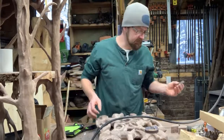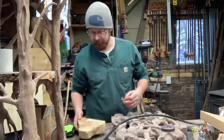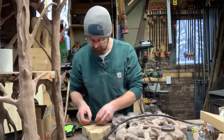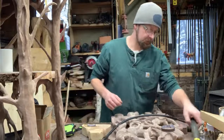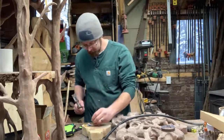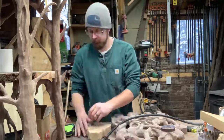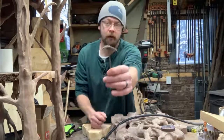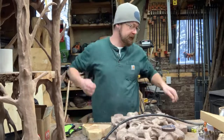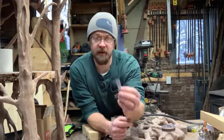Now, you gotta have a hole for that screw to go through. So I got a block of wood with some holes in them already. Line up all 4 pieces, because I put 4 pieces on there at a time, over the hole. Grab myself a hammer and just a big nail. Line it up. Punch it through. And then you're good to go. So I'll make a handful of these, so when I start sanding, I'm all set. And I'll just set this aside.